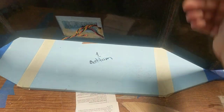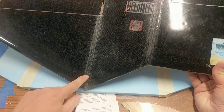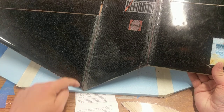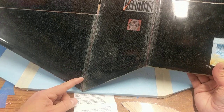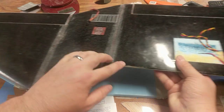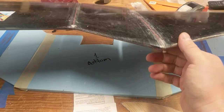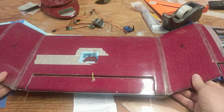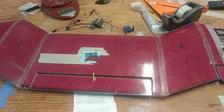That will be everything needed to make it fly. Then I just need to do the CG. I'm going to fill up these tips — put a little hole, get all that foam out, and put lead in there kept in place with epoxy. When you think about this whole plane, everything on it has to balance right there, and there's quite a lot of area to put some lead up in there. So this is the second-to-last booby build log — it's coming along quick now.